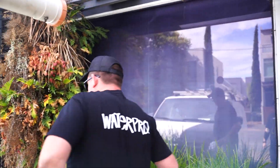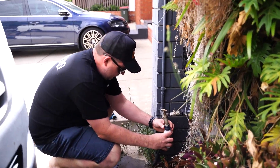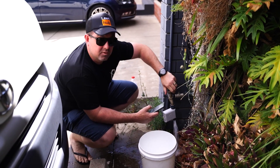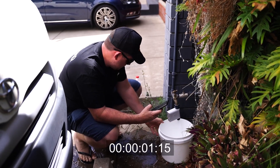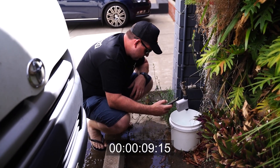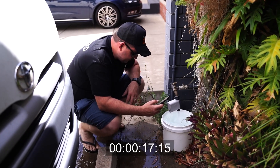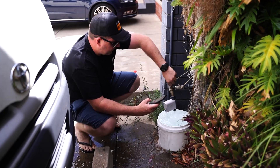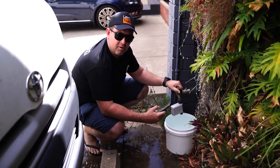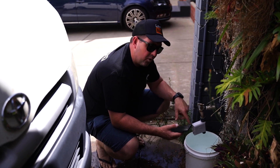I think we're going to see a bit of a difference now. We're just hitting 15 seconds... and I'm going to say that's 20 seconds. So that's a noticeable difference. Working on just the 15 and 20 seconds, that's a 33% or 25% difference depending on which way you look at it. So if we're working with 30 litres a minute and we lose 25 to 30%, we're down to 20 — which is confirming my suspicions about the job in question.